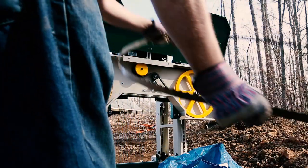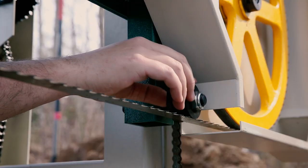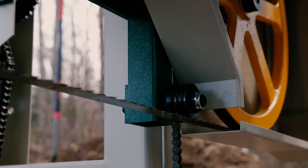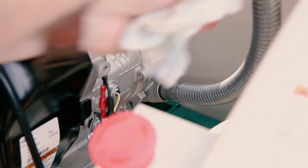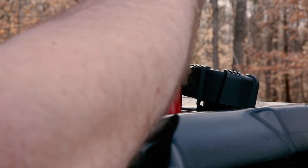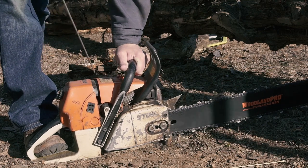With the mill assembled, I put the blade on and tensioned it. The wheels are 18.75 inches, which after talking to some people at Timberwolf Blades, is a great size wheel as it doesn't fatigue the metal as much as some other mills with smaller wheels. Then I turned my attention to the engine. The mill comes with a 420cc, 13.5hp Briggs & Stratton engine. I added the motor oil that Briggs & Stratton recommends for my climate, which just happened to be 10W30, then added gas. Briggs & Stratton says to add fuel stabilizer to regular ethanol gas, but for any of my gas tools I like to use non-ethanol gas as a habit to keep the engines clean, and it's readily accessible to me.